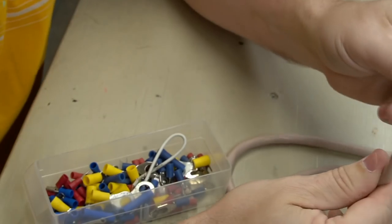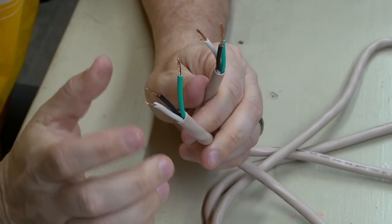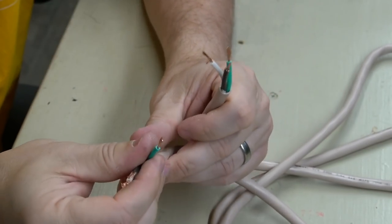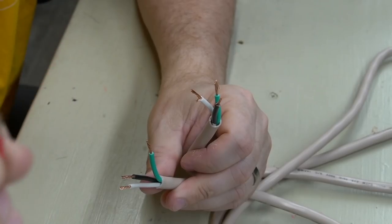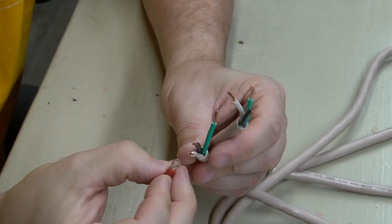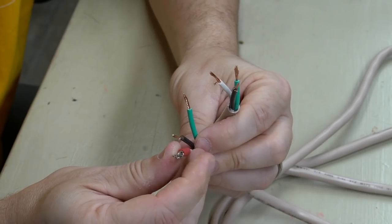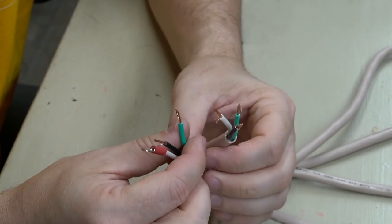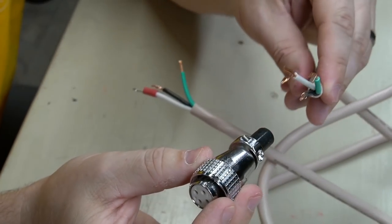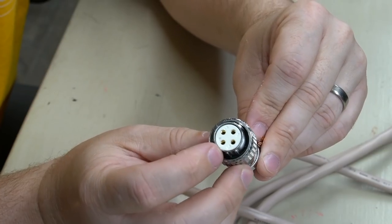Alright, so we have our wires here. You can see both ends of one of the wires — one goes to the spindle and one goes to the VFD. What we're going to do is attach these little terminal connector pieces. We're going to connect those onto one end of the wires — they just slide through and then you squeeze them tight and closed. The other end we're going to use this little piece that came with the VFD, where the wires go inside and connect to the pins.